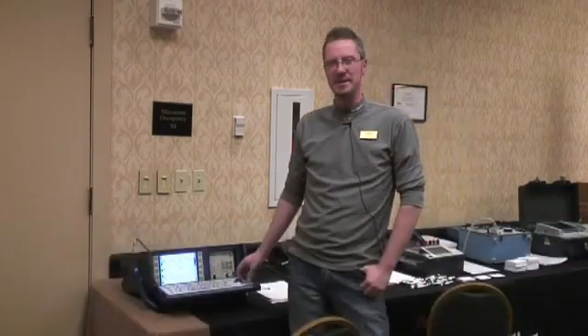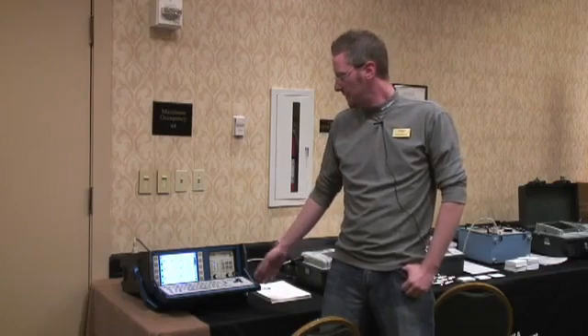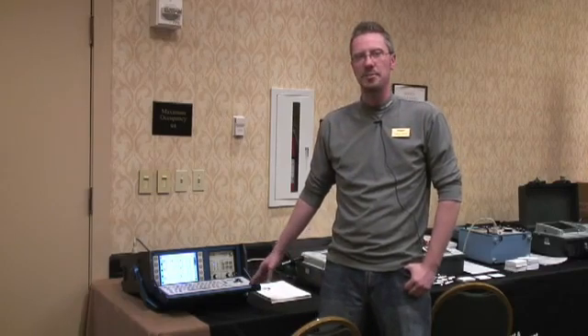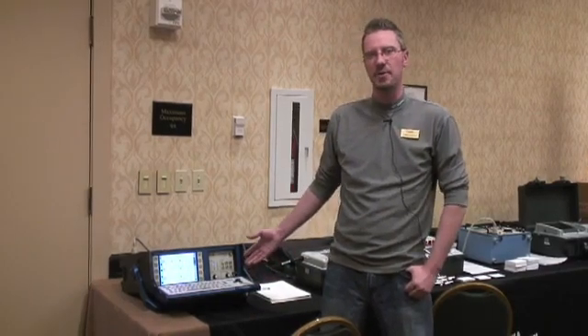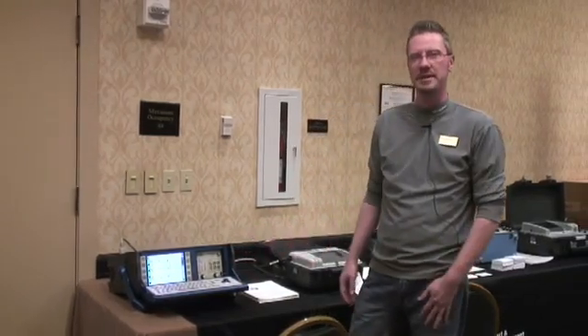Hi, I'm Charles Gentle, technical sales representative from Megger in the Carolinas region. Today we're looking at the TM1800 breaker timer. The TM1800 is one of a kind in the market. It is the only product that allows dual ground testing of breakers, which means that we do not need to lift the ground on both ends of the breaker to complete testing.